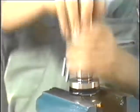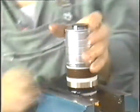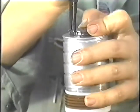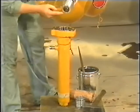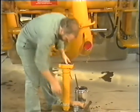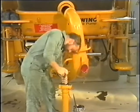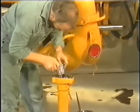We then place the pre-mounted piston bush onto the pre-mounted piston pin and then mount the supporting ring and circlip locking ring. After moistening the cylinder wall with hydraulic oil, the complete piston can be inserted in the cylinder. Only wooden objects may be used to press the piston up to the stop — never use an iron rod. After the bearing bush is inserted, the cylinder is ready for mounting.